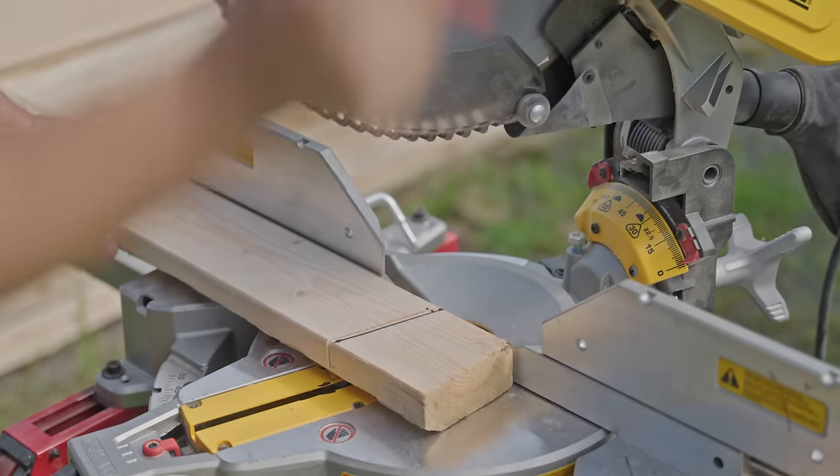All right. What I'm going to do is I'm going to get this measurement. Now, this becomes the nailing or screwing surface of my facade. You see how it hangs down? I got room for my siding underneath here with no more additional help. I'm going to just go like this. Okay. Mark that tip. I'm gonna try it in all four corners and make sure that it's in the same position. I'm also gonna do this line here so we can have a visual.